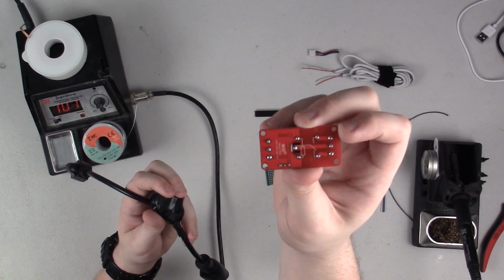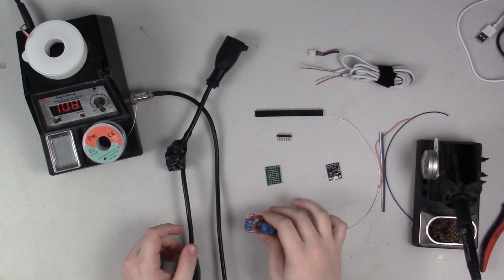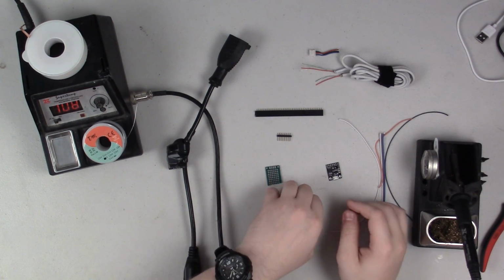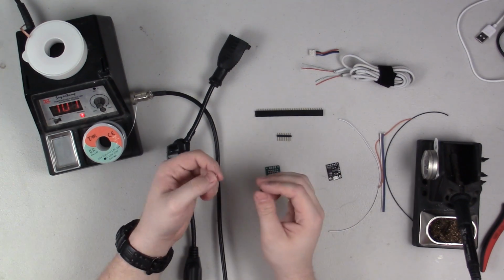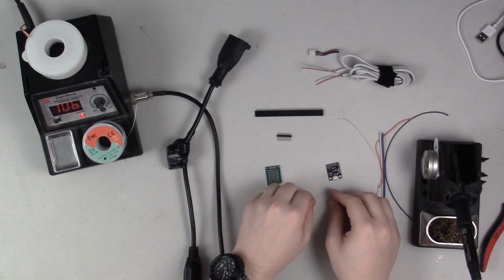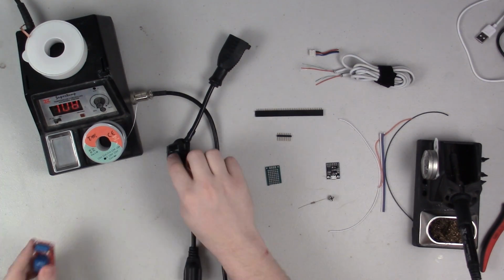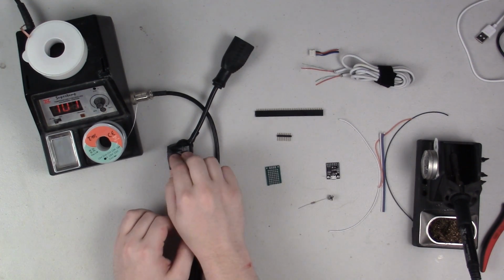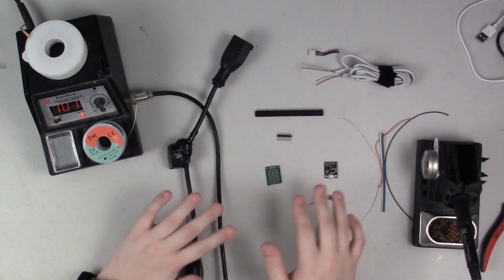So that's normally open. So that's the brains in the Digispark, or Digistump, and then a relay module to actually control the live wires. Now, the last component or part of this project is a button and a little pull down resistor here. So I'm going to connect these up to one of the pins on the Digispark, and then another one of the pins will connect to this relay here. And when I push the button, it will automatically turn the relay on for a specific amount of time. So with any luck, it should be pretty easy to put together.